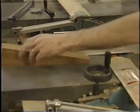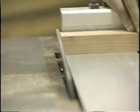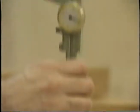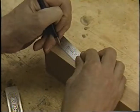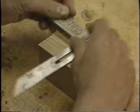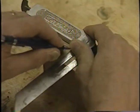Getting the overall length of the angled side rail is a little more complicated than the procedure for a square rail. First, I bevel the end of the rail with the blade set to the same angle I used for the wedge. I take the exact mortise depth on the front leg that connects with this rail. I rule off the tenon length, which is a smidge less than the mortise depth, with a ruler set perpendicular to the end bevel. And I draw in the angled shoulder line.